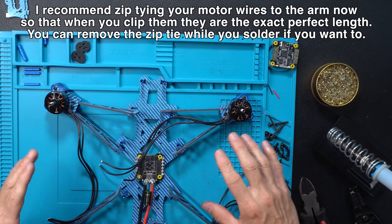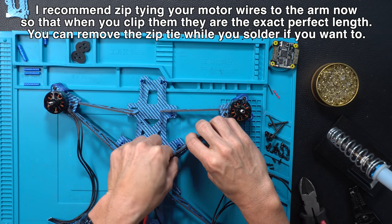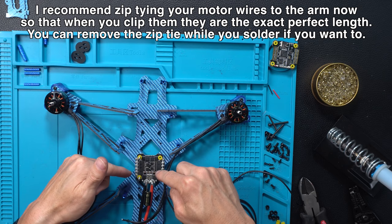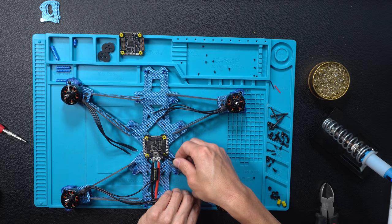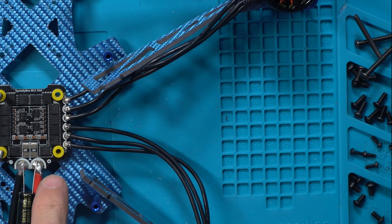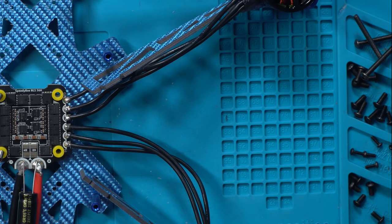We've got this loosely mocked up. I'm going to start measuring some motor wires, clipping them to length. We're going to run the wires to the inside of the arm and hold them with a zip tie as they come in. I want to keep everything really loose and not locked down because I still want to put conformal coating on the bottom side and the top afterwards — I need to be able to flip everything upside down for all of that. All the wires are trimmed down, now I just got to go through and tin all of the tips and then put them onto the board. Judgment time — are they all perfectly beautiful? No, but are they solid? Absolutely. There was good liquification. Now I'm going to flip this over, glaze it with conformal coating, and we'll react for the next step.